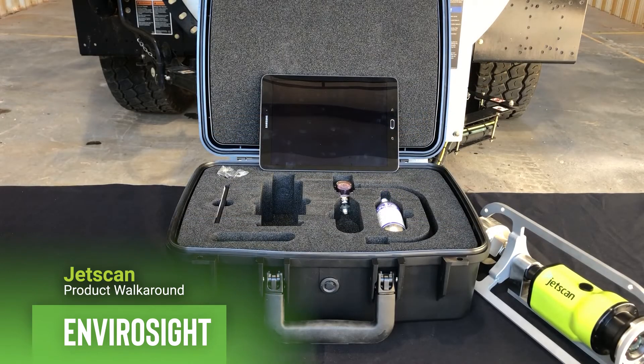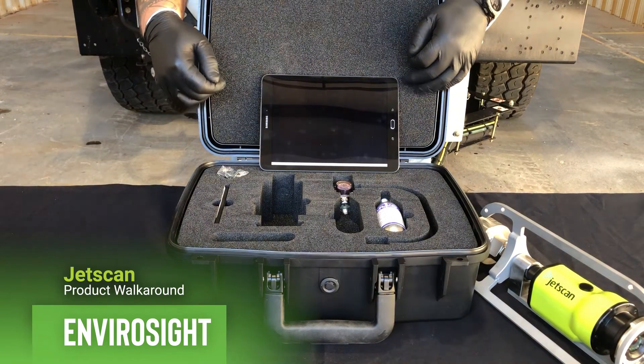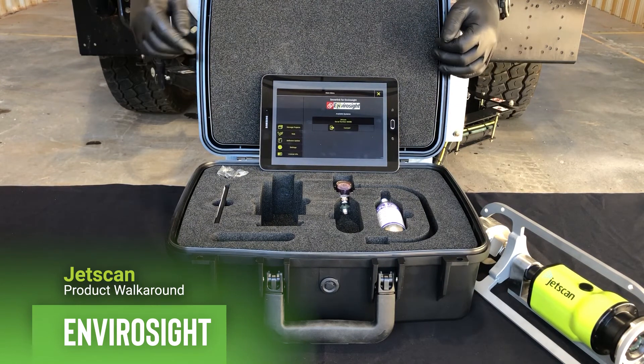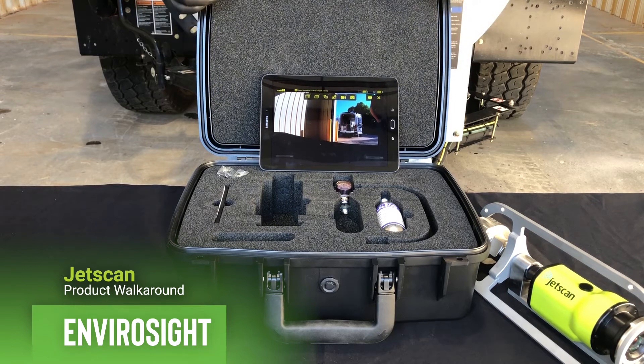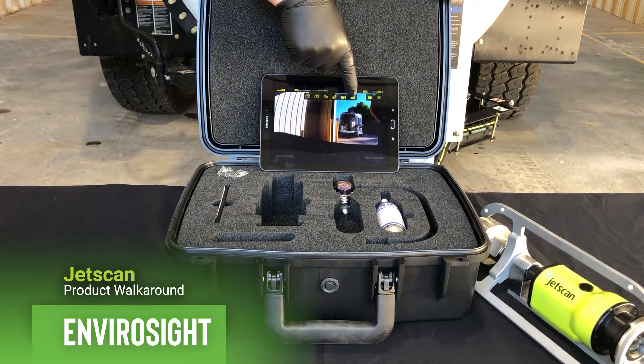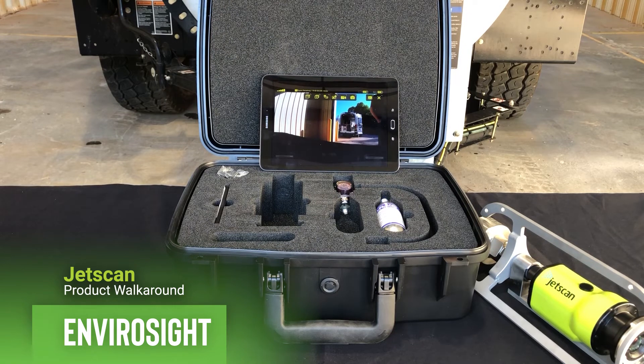You can utilize any of your smart tablets, whether it's Apple, Android, or Windows. Just go to your App Store and download the free SewerLink app. Once it's installed and your JetScan is powered up, it's a simple one-touch to connect. You're operational and have several choices: you can take still images, take video, enter inspection information such as manhole numbers and map ID numbers, create a miniature survey, and it's also WinCan compatible using WinCan Web. You can wirelessly upload all your inspection data to the web and integrate it into your software.